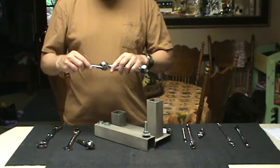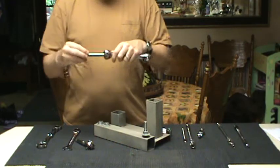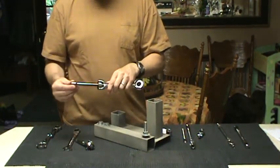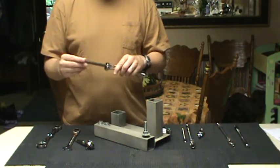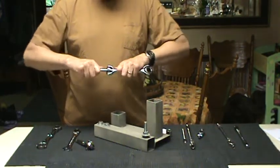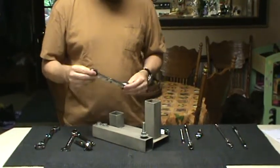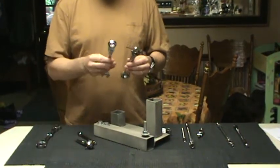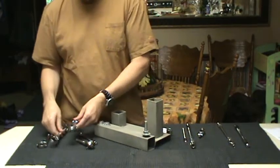And the extension port with a 3/8 size extension would work in all the way down to 1/2 inch or 13 millimeter. And if you want an extension port in a smaller wrench, you would have to go down to a 1/4 inch drive extension. But you know, again, this wrench works very well, and it solves a lot of the problems that haven't been addressed with the wrench that's currently on the market.